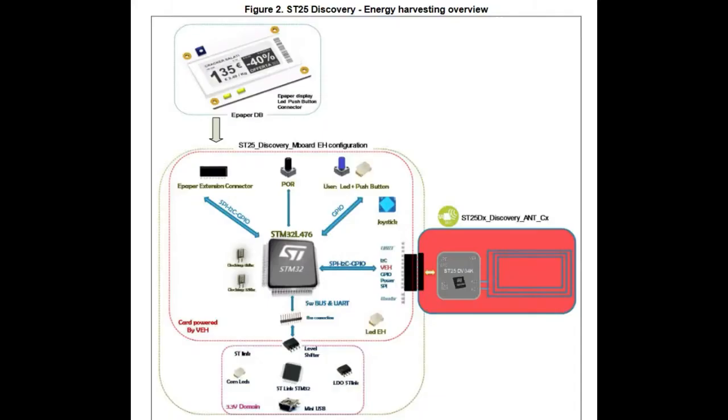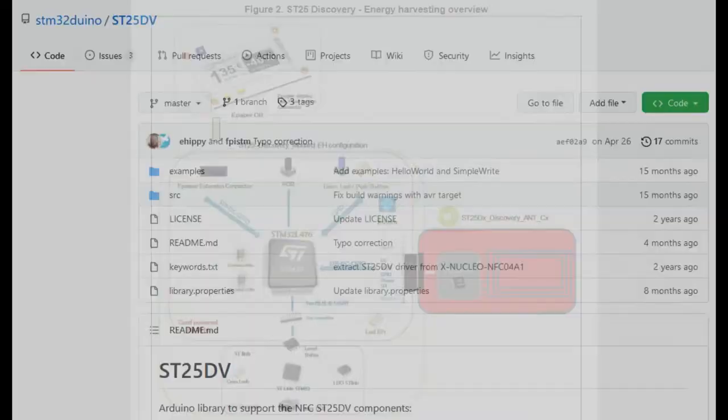Here's a design for an e-ink tag that is completely reprogrammed over NFC — data is transmitted and reprogrammed over NFC. You're going to have to hold that NFC tag fairly close so it can go through the update cycle, which takes 20 seconds. But you don't have a battery. Maybe from a meter away, this is useful enough.